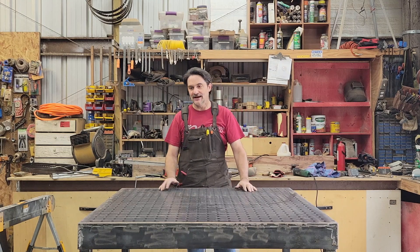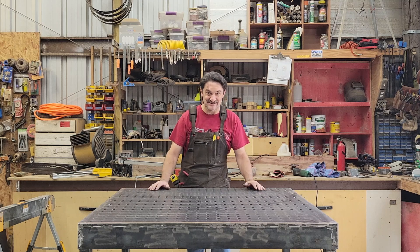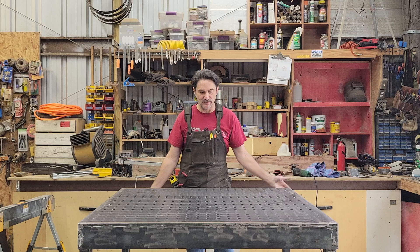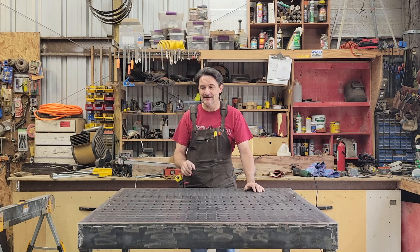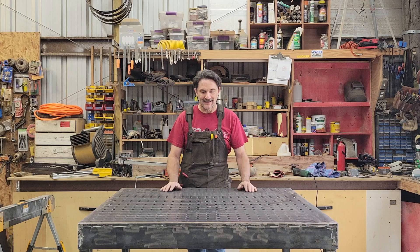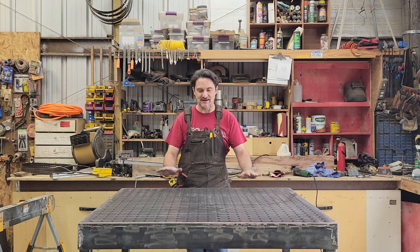These tables, 4x4 finished out, they run $2,500 to $3,500. You can buy a kit and those things still run $1,500 to $1,800, and you still have to weld it out yourself. What I have here is a 4x4 half inch plate drilled out. I've also built the grid underneath for support out of 4 inch quarter inch flat plate, then 2 inch tubes for the legs with some 4 inch casters. All in, I'm about $600 total into the build and probably about six hours of welding time — overall not a bad price for something that costs a whole lot of money.